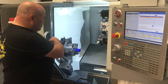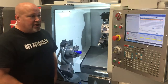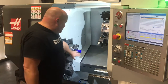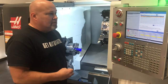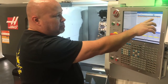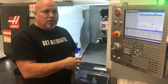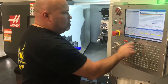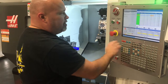Today we're going to talk about teaching our tools without having a tool setter. Things are a little different — if I don't have a tool setter, I'm going to use my workpiece as a reference to teach this tool offset. Item number one is going to be under the settings page, setting number 64. We've got to make sure that setting is turned on because I do want to use my work shift as a reference for my tool offsets.